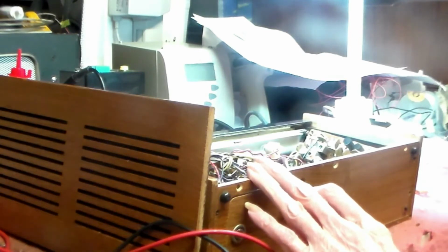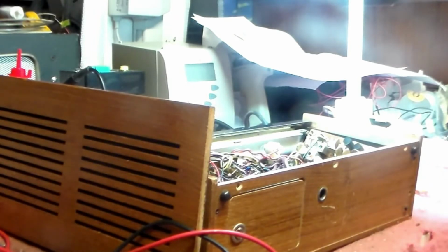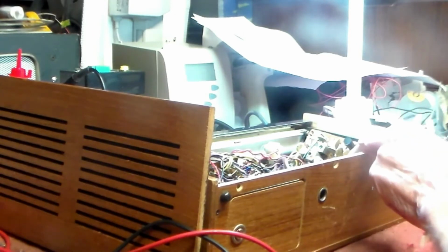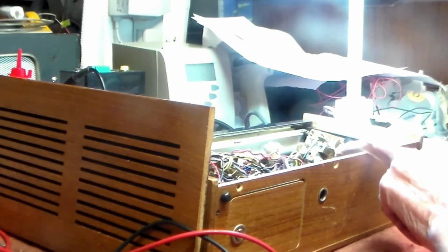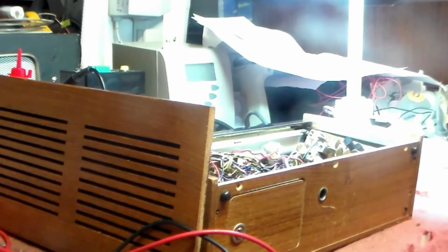The problems it had were not going down to zero on the volume and the tone control not working. Now the volume control side of it is sorted, and the tone is nearly there. But in between now and then, one of the transistors on the IF board, the AF117, has blown. And so I'm going to try and find something that will go in its place. For this you can find a number of transistors that can be put in its place. One is the AF127.